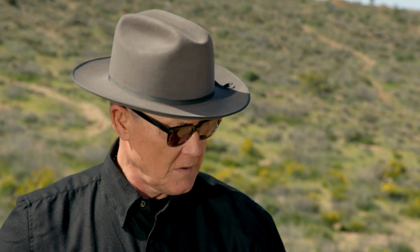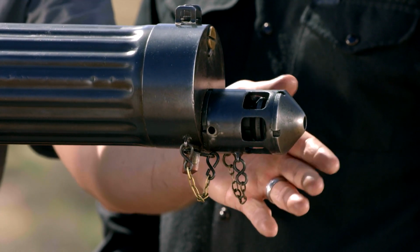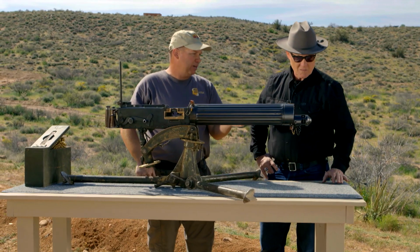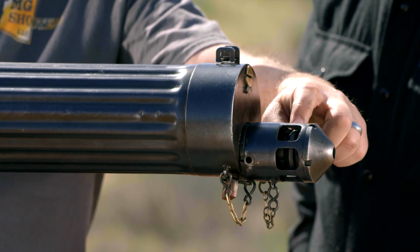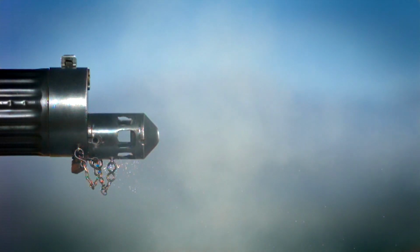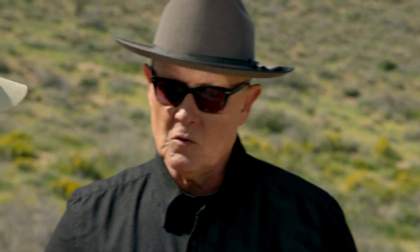And what is this? Is it some sort of muzzle booster? This is actually the muzzle booster, and as I'd mentioned, this is a recoil-operated gun. So the gases would come out and hit the muzzle booster in here, and that would produce a backward force, and it forces the barrel back and operates the entire action. On that compression alone right there. Yep, cool.